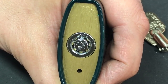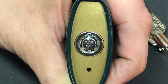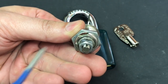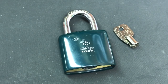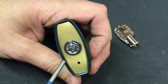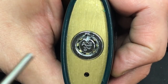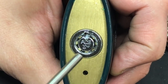Another way to drill these locks out is to drill for the pin that keeps the core from rotating in the lock body. It's easy to see on a cam lock — we have a pin right there that keeps the circular core from rotating in the cam lock body. Similarly, we have a pin that goes in the side of this padlock that keeps the core from rotating inside the padlock body. They are almost always at the 12 o'clock position, so you can drill right down the center at 12 o'clock and shear off that pin, after which you can rotate the whole core and open up the lock.